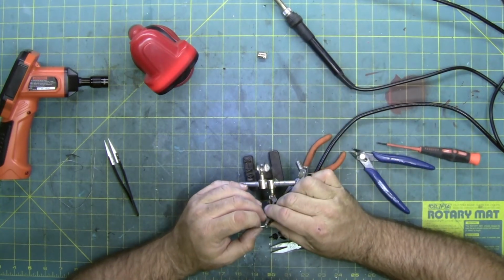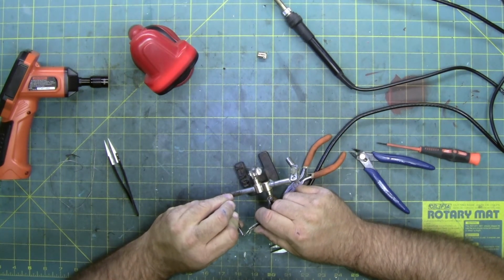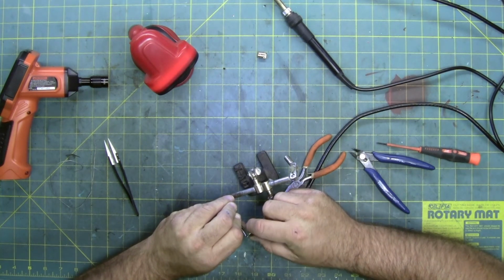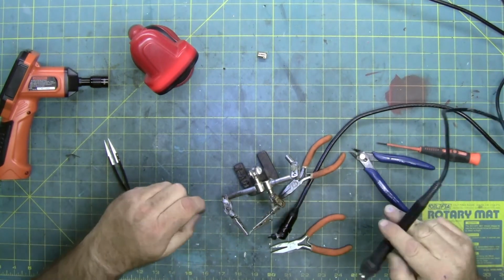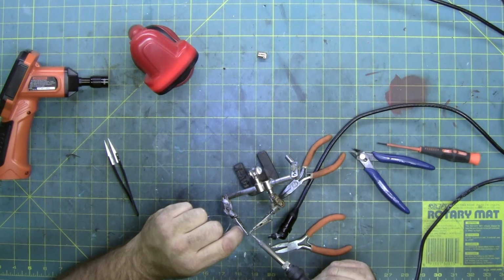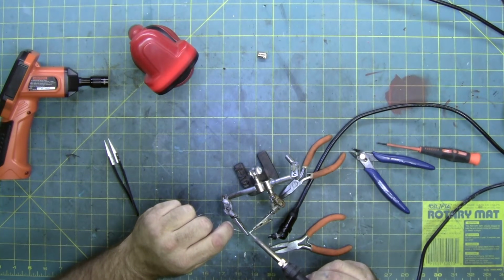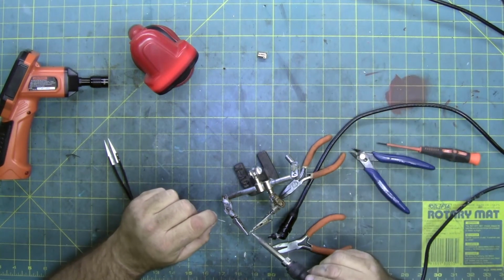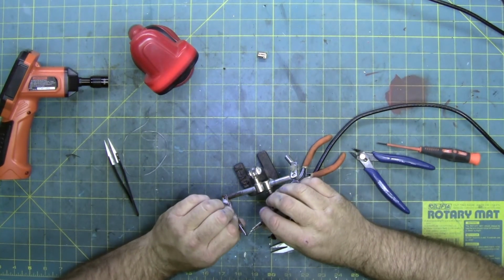because I'm soldering in a heat sink, which are these jaws, because they're metal, so they're dissipating the heat again. So I want to make sure that the solder is good, so the pressure of putting it together with the other part, the camera end, is good. Excess solder off. There, that's a little better. I'm also using, again, magnifying glasses so I can see better.